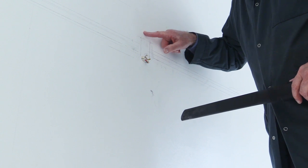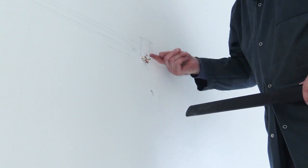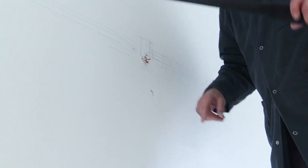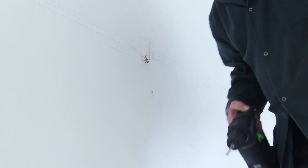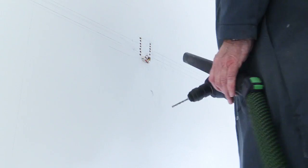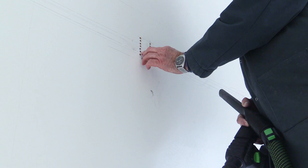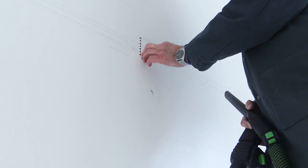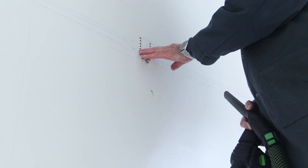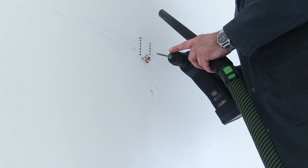These wires are going to go up here. What I'm going to do is very carefully with the drill just drill around here so I can break away the plaster and hopefully not risk damaging any of the wires. I was only going down probably about eight millimetres in each of these little holes, and as soon as I felt any resistance I stopped. I didn't have it in hammer action — I had it in just rotating mode.